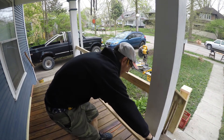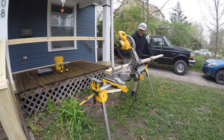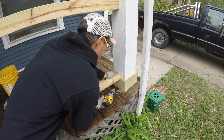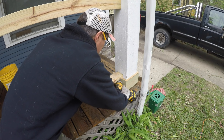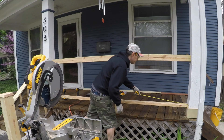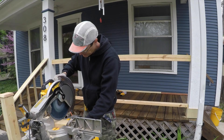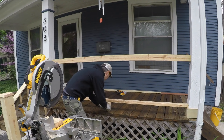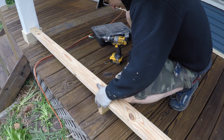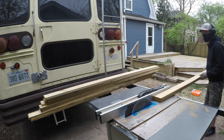The lower 2x4 goes horizontally — flat — which allows you to capture your balusters. One key consideration when building a railing is where your load is going to go. I wanted mine to go down onto the deck, not onto the fasteners on the side, so I located a small 2x4 block in the middle. The ends of my bottom 2x4 are placed on top of some trim pieces, distributing the load in three places.